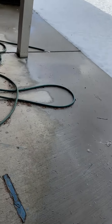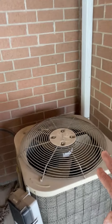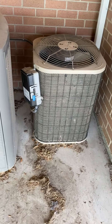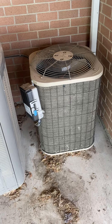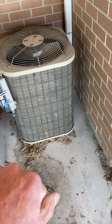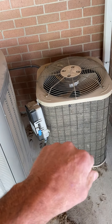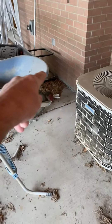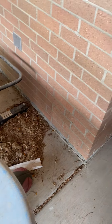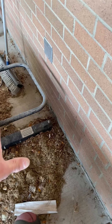Verify this — I was told this is our AC here, the one on the far left. Our new one will not fit here. I talked with Jason and the homeowner and we decided to put the new one over here. You have all the line sets that go back here, so you're just going to have to run the line set — make sure you have enough to come over and put the AC right here.